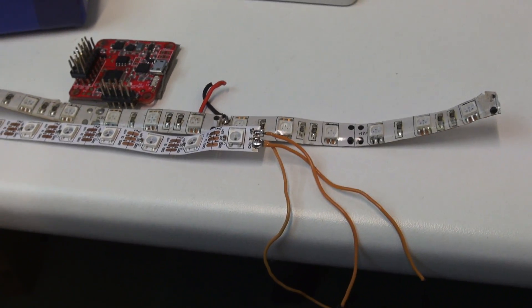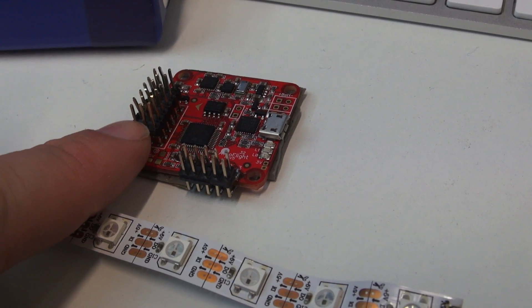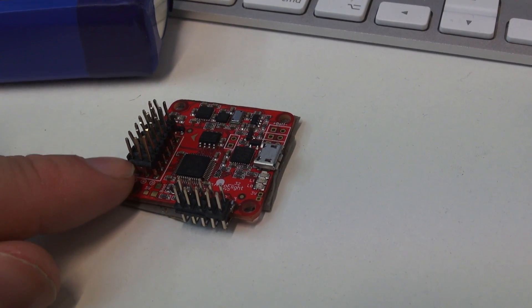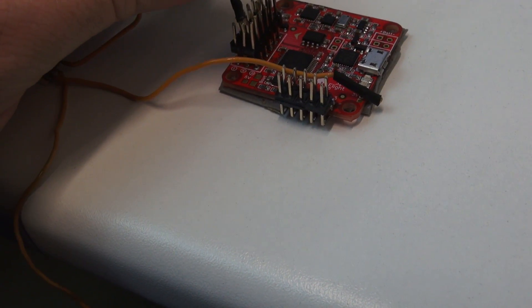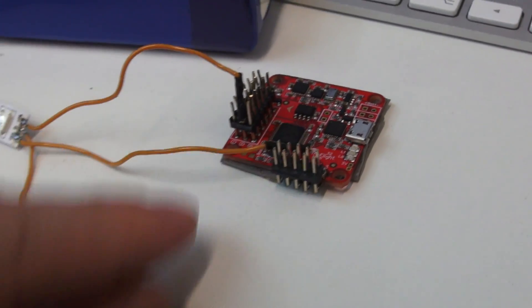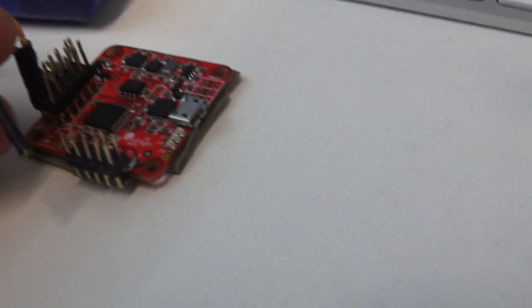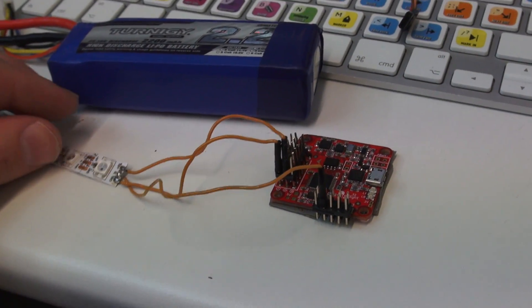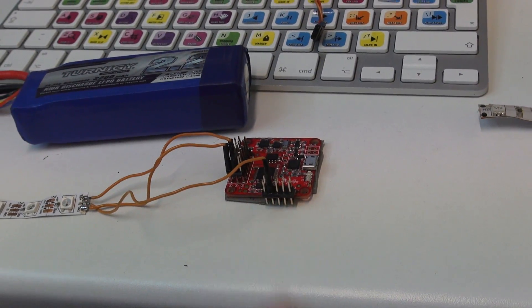To get the power and the signal in, it's really simple. If we have a look on the flight controller, you can see here where we actually plug the ESCs into - we've got all these prongs here, with a negative and a positive. So we've got our ground and 5-volt positive to power the LEDs. We've got our plus 5 volts here, so I'll plug that in to the middle on one of the spare ports. On the outside we've got our ground, so I'll plug that one in there. And for the LED signal, it actually goes here onto number 5. I've got 10 here at the moment - you can continue around, I think it's about 32 that you can program into it.